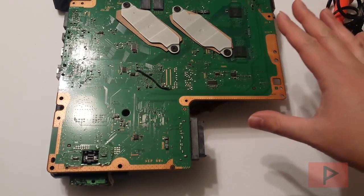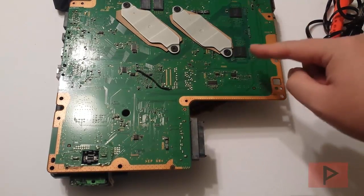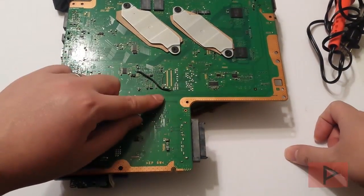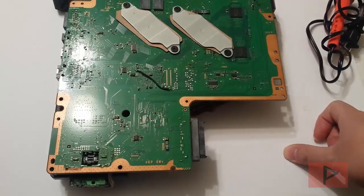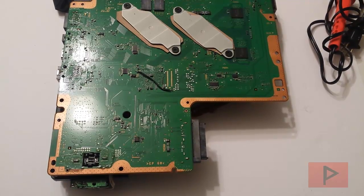Today's video tutorial is strictly on how to unbrick your PS3. The most important takeaway is: first, find your correct motherboard schematic so you know where the NOR tri-state and ground connection are — the solder method is best, but tape works if it works for you. Second, make sure you have a verified dump. If you have a good dump, patch it, put it back on the PS3, and you'll have no more yellow light of death. Leave any questions in the YouTube comments and I'll get back to you.